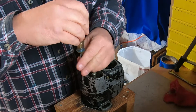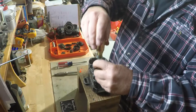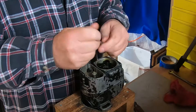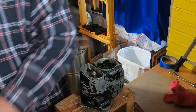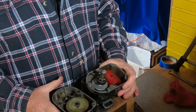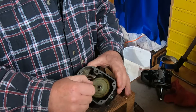Continue on, just taking the screws out — these screws are all gnarly too, they'll get all new hardware. This thing will look like a new penny when we're all done with it. We're going to slowly pull the housing up, poke the primary lead through the little hole, and make sure we don't pull on that too tight. One half of the magneto — we're going to pull the carbon brush out. That will be replaced.